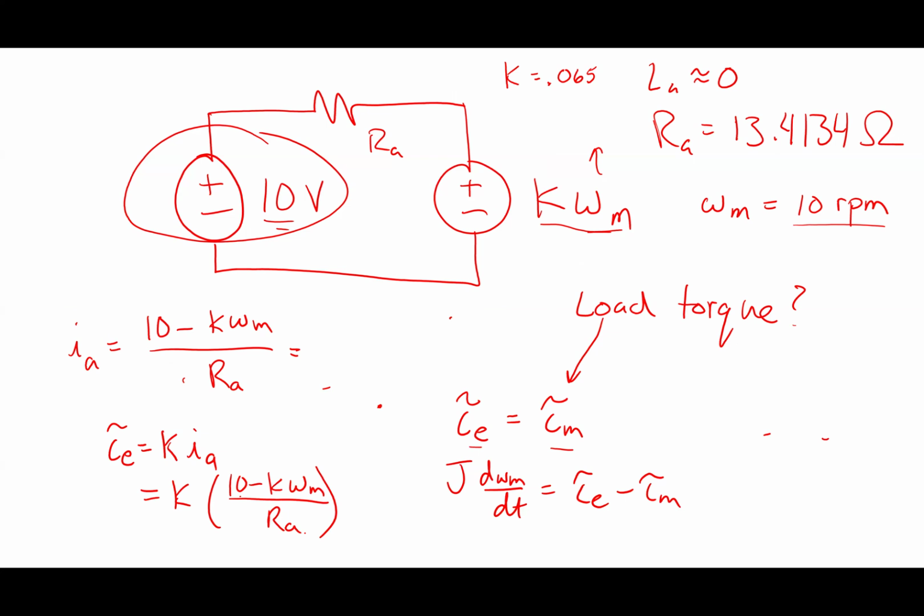All right, now, what's the maximum amount of torque I could ever apply? I call this the stall torque. What's the maximum amount of torque I could ever have this machine make for me? In the case that I gave here, where I ran this motor on my test setup, there was a maximum torque I could ever get it to do. I could grab the shaft hard enough and it would stop, right? How would I figure out that maximum amount of torque?